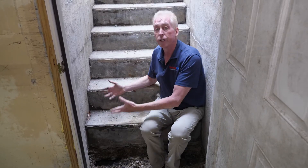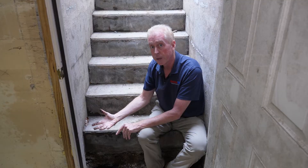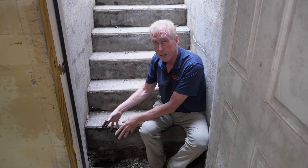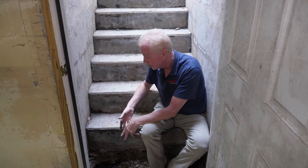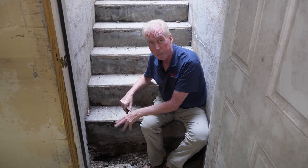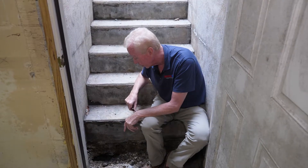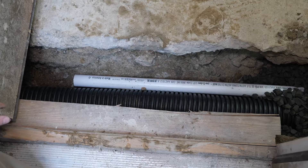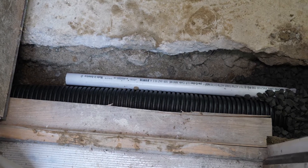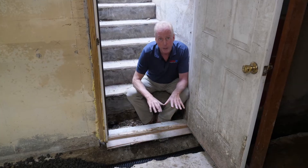When you have footing drains and you put dirt on top of them, the water is going to travel through that dirt down to where the drainage is, and you can't help but have that soil migrate with it and clog the pipe itself. Over time, this particular type of pipe actually breaks down and collapses, kind of like what it's doing here. The system we're putting in on the inside is going to have every bit of the effect that this system was trying to have on the outside — we're just not putting eight feet of dirt on top of our drainage.